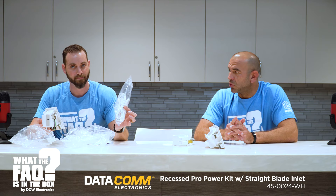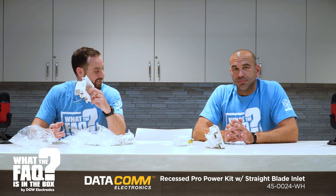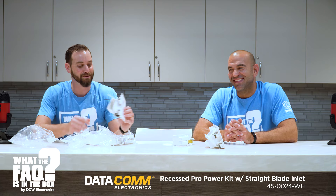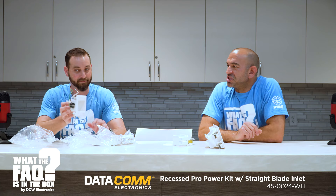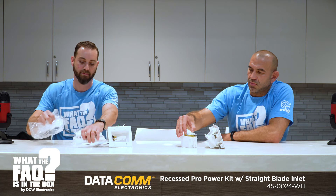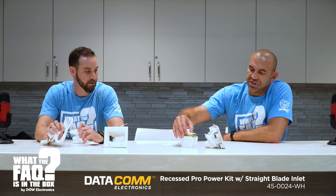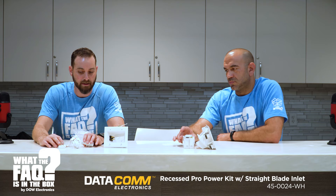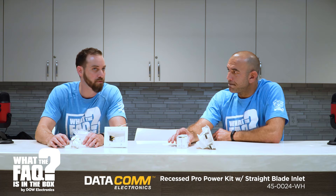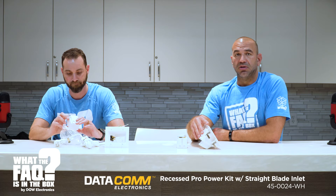That's basically going to allow you to use the extension cable on the bottom — you're going to plug that into an outlet behind the credenza, and it plugs right in here. Again, you do have another hood on this. This one would sit like this — why does it sit this way? Fish the wires down from the wall, out through the upside-down hood, and smooth rundown. Why wouldn't you just sink an outlet in the wall? Low voltage electrician licensing is one thing. Also, you already have power run down near where most of your components are going to be. Why run another cable from the attic when you can use this extension cable into this box and run one single piece of Romex up the wall where you're already fishing all your components anyway? And when you recess it, you have the ability to flatten that TV against the wall for an even tighter look.